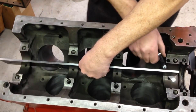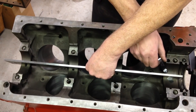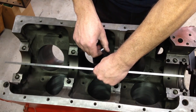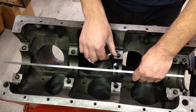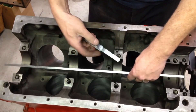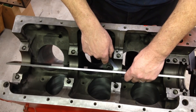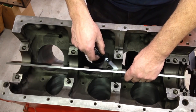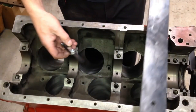We go to the next one — it's not sliding. Then the last one — no movement. I can't slide the blade in and out. I'm pushing on it and it is not moving. You're looking to see if there's a gap or if the blade will actually slide under there — and it won't. So what that tells me is that these bores are in a perfectly straight line.